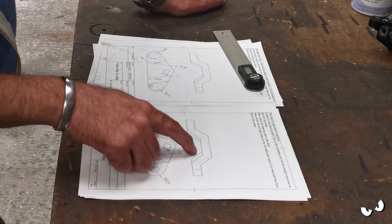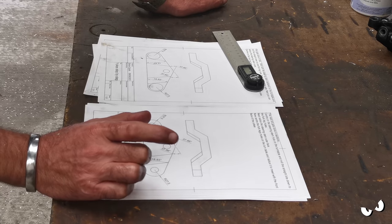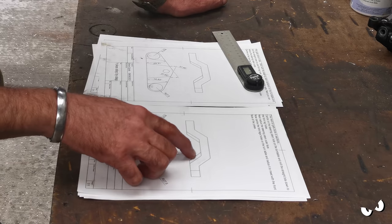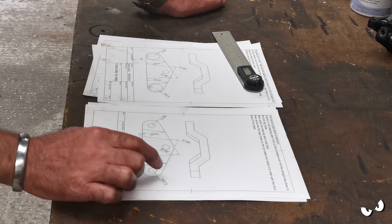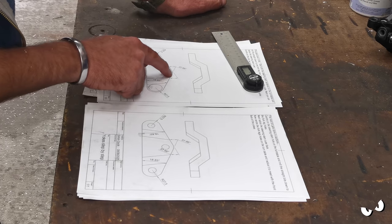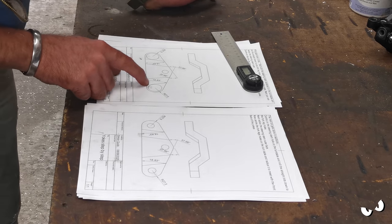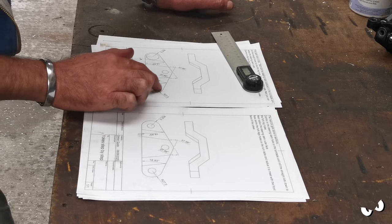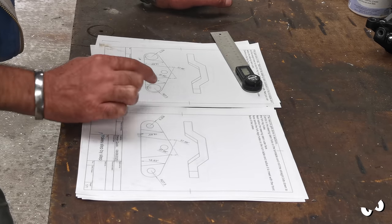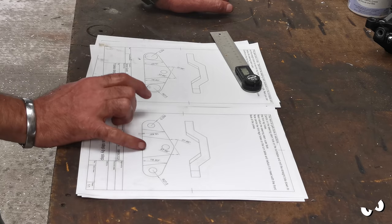However, when I was doing these slopey bits down here the first time round, I set it up using a digital protractor, which is pretty accurate, really. I had a reference off the table. I zeroed it out properly and everything else, but I still came up a little bit off. And the worry that I've got is if I put these slopes in here first, and then I bore the holes for the forks to go through, if those angles are even a tiny bit off, you're going to notice, because this edge round here, that's 5mm on the stock yokes, and that's what I'm going for here. But if that angle's wrong and this ends up being 4mm or 6mm, that hole isn't going to be central to that radius, and you're going to see it, and I don't want that. So we might be switching these around.